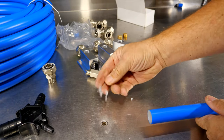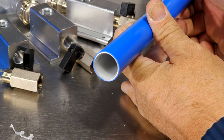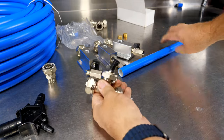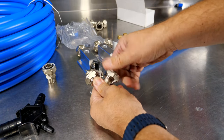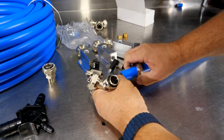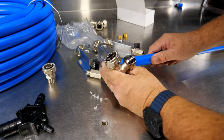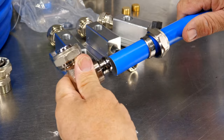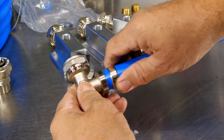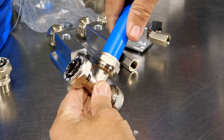And you see the shavings there. And if you look on the inside of this pipe, you'll see a nice bevel on the inside. And then you'll take your fitting, remove the nut, slide it on the pipe, take the ring, slide it on the pipe, and then we're just going to push this onto here. So let it seat all the way at the bottom, slide that on, and then get that finger tight, and